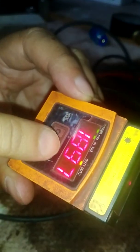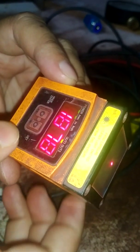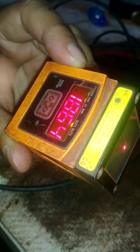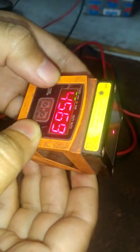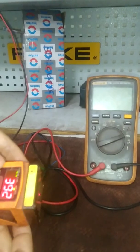Now we will exit the programming mode. On the display it is showing 1800 to 1900 mm. As we set it at 1990 mm, when the distance is less than that, the out one LED will glow. The milliamp value is fluctuating based on the distance of the object. As the object moves farther away, the milliamps increase and the display shows higher values — for example, 4500 mm — and then it gradually comes back down.